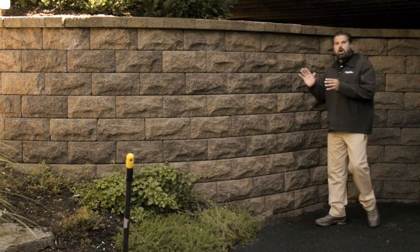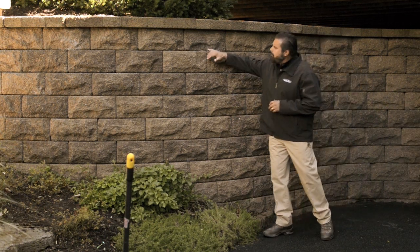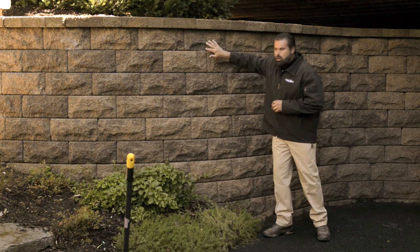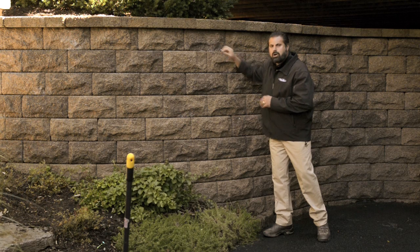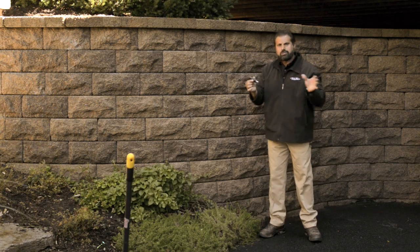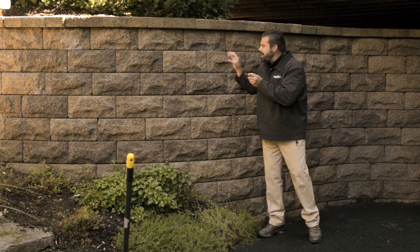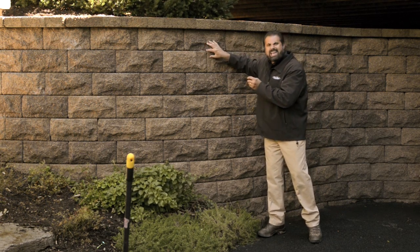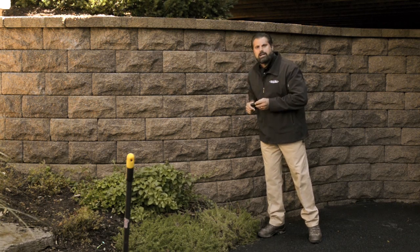As you can see, our wall's been cleaned with a FlexLock efflorescence remover. There are only a couple of stubborn stains, so we have about a 90% improvement. But we want to get this crevice cleaned out before we seal it. So we're going to use a conical tip on our pressure washer that will distribute the load or pressure from that machine so that we don't have any etching in our wall. We'll be able to clean that crevice and we'll be ready to go with sealer.